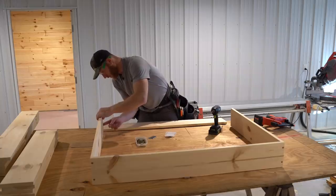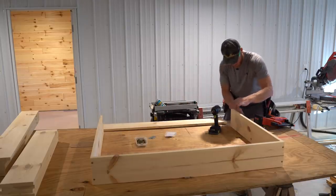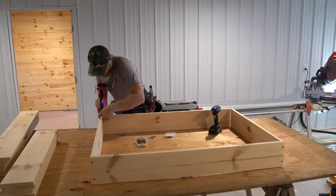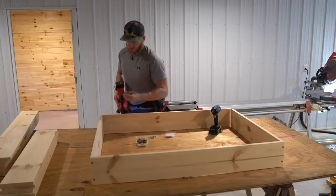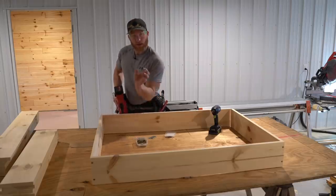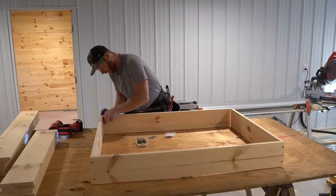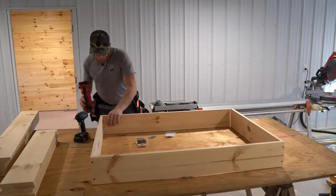That's just a little tip. I'm not sure where I was introduced to pre-building your boxes, but I used to cut the tops, bottoms, and sides, then go into the window opening — put the top on, set the bottom down, and slide the two sides in. The problem was it was a real pain to get all your reveals looking perfect and keeping everything square so a board wasn't cocked. You might be asking how I'm going to put this in as a box and get it all perfect — I'll show you. It's a trick I learned from Andy Moore, from Modern Oak. When I saw him do it, it blew me away, and I've been doing it this way ever since.